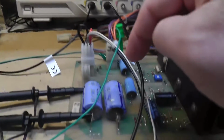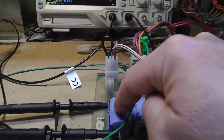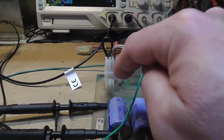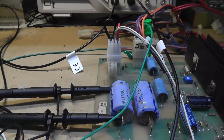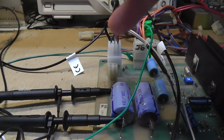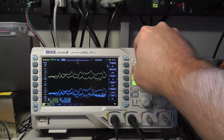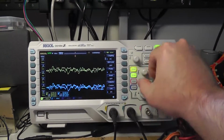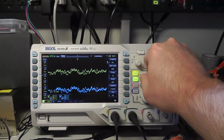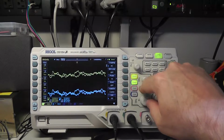Why is that? Now, channel 1 is pre-capacitor. This is coming from the amplifier, and so this is where I need to study the DC voltage. There should be no DC on there to actually do the trigger anyway. But hey, that's kind of weird. Why, I don't know. I keep adjusting the wrong damn thing. Right there. But anyway, that's how channel 2.